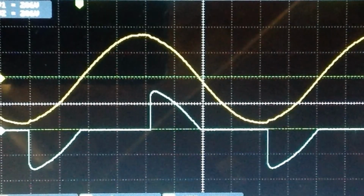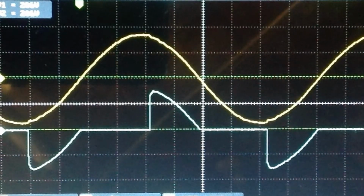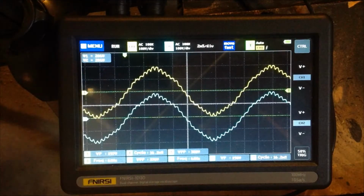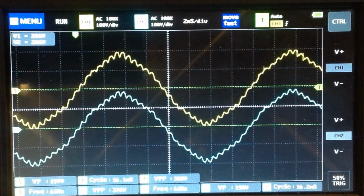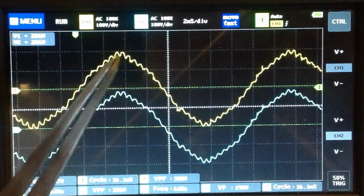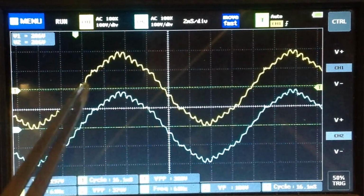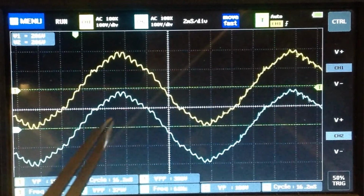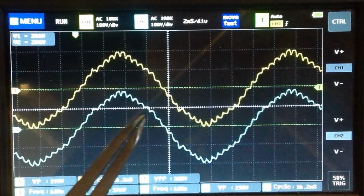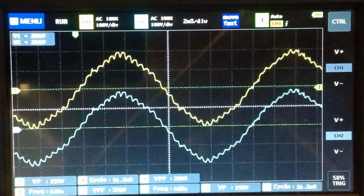Okay, now I'm going to shut the camera down for a minute or two and bring the power on using the generator. Now I've got my Westinghouse 3.6 kW generator supplying the power. Again, the waveform, of course, is not quite so smooth since it's coming off of my generator, and the upper one, the yellow one, represents the output to the dimmer, and then the voltage to the 500 watt lamp. The waveform is the lower blue trace.